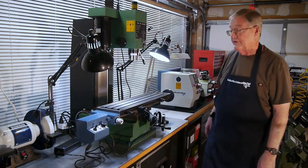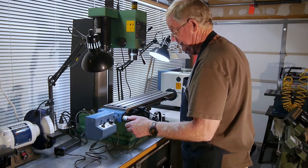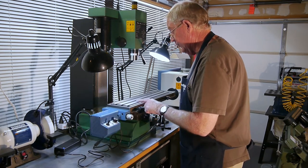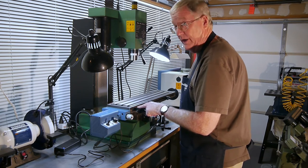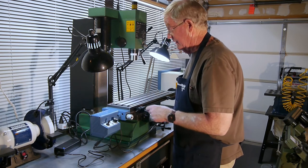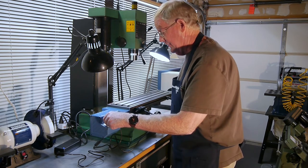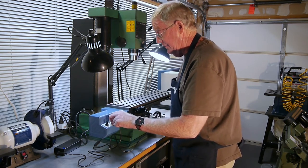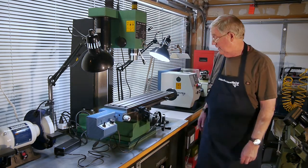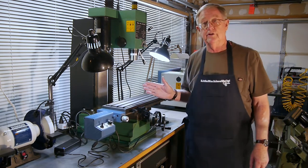You can traverse in either direction. You'll notice that when the trigger on the table approaches the switch, it'll automatically stop the mill — that's in case you forget to stop it before reaching the end. If you want to go in another direction at a cutting speed more appropriate for milling with a fine finish, you can run it as slow as you want and get that nice smooth traversal that a good cut requires.